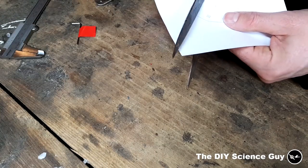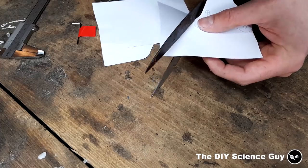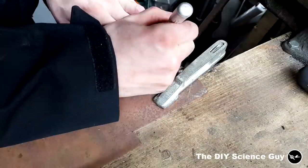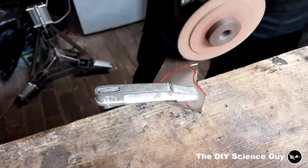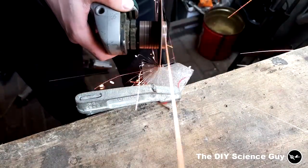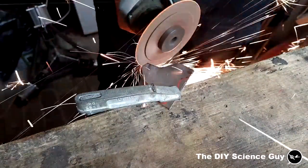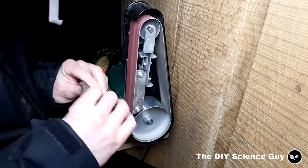Here I'm making the connecting piece to which all the valve gears will be connected. Only the high pressure eccentric rod is fixed to this. The eccentric rod will be set at a 90 degree angle relative to the stroke of the piston. This way I don't need to use an eccentric crank, which would be a difficult part to keep properly fixed to the crank pin without it getting loose over time, because I didn't want to weld it on. And in contrast to a steam train, I have a lot of space to work with.